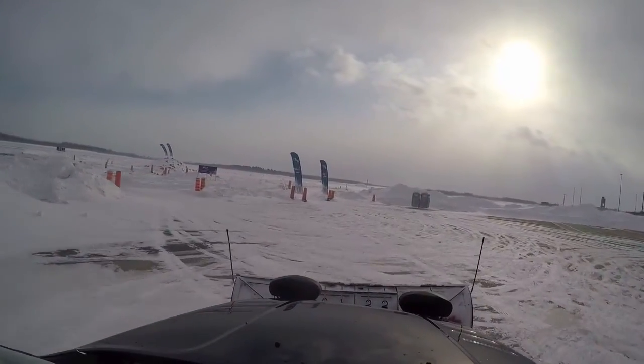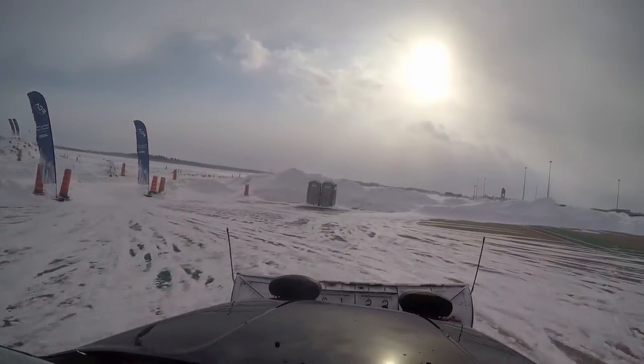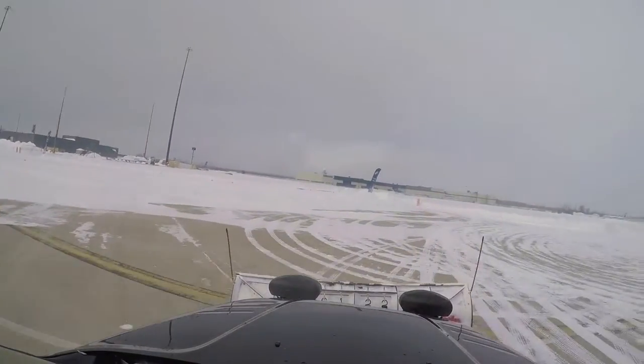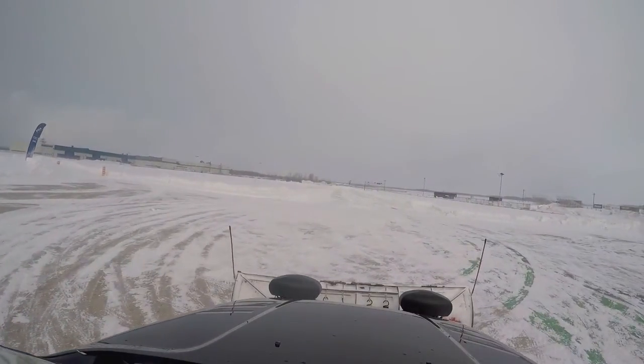As you come to the end of your run, pick up the blade. This is fun — it's a pretty serious job. Line up the truck at the end of this area because we're going to make a faster pass next time. Spin around, line straight up at it. You see that clean cut you did on the left-hand side? I want you to cut in about a foot and a half and shoot the snow that way. I want you to cut the right side of that line — shoot the snow to the left and cut in to the right side about a foot and a half.